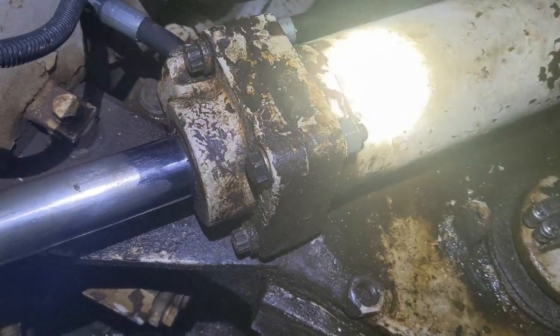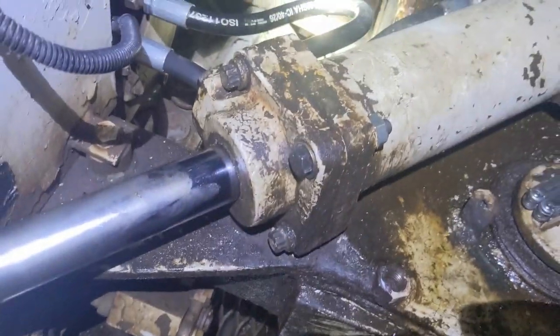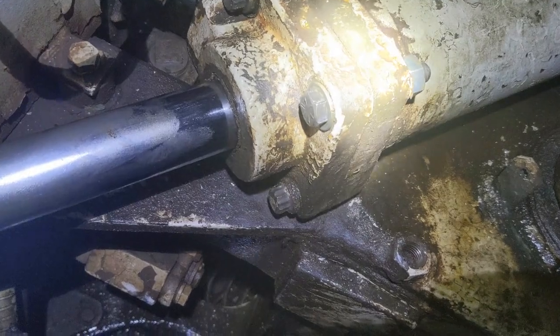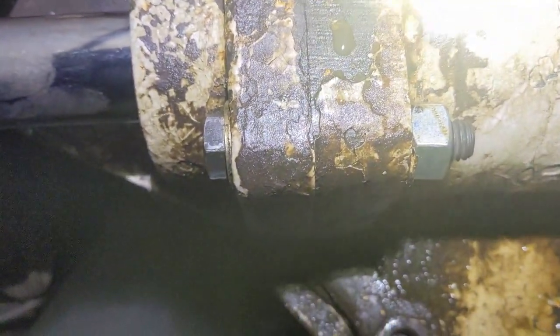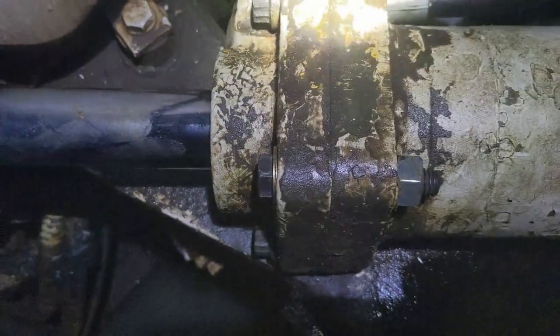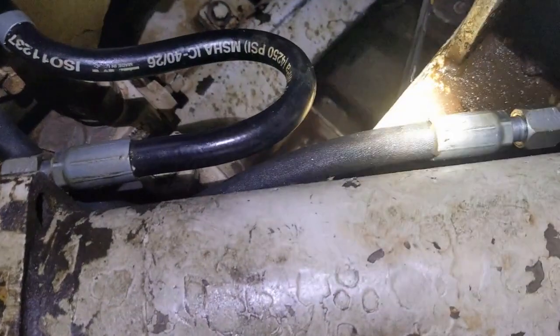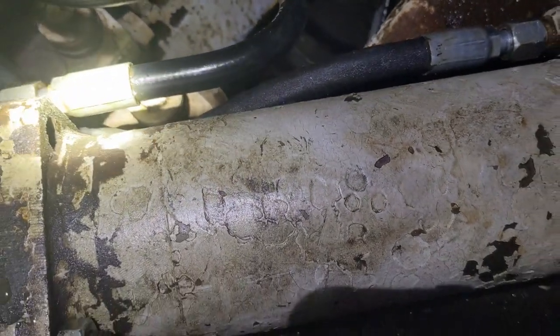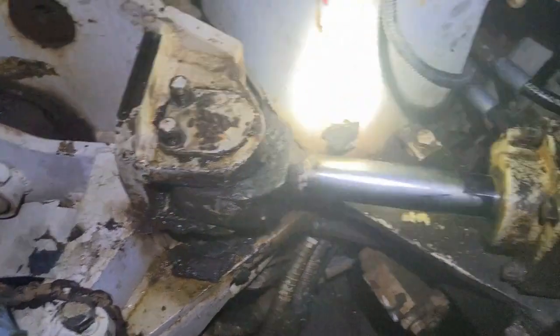It's going to need to be tapped, possibly for a larger size bolt. What I just did is I found an undersized bolt, a washer to kind of distribute the force across the gland end, and a nut. I torqued it until the bolt kind of bent a little bit, but more importantly the cylinder halves made it together. There's no gap — compare that to what it was like before we started. And I swapped out the other side steering hose and put the pins back in.